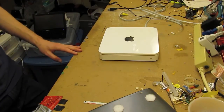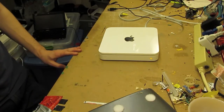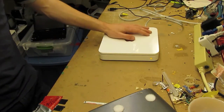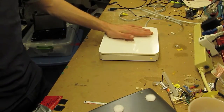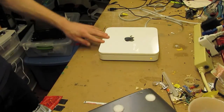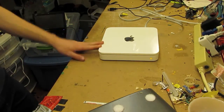The caps in this one are probably dodgy and failing, but not already failed all the way, since it does manage to power up and does seem to be stable when it's just sitting here. So I think the next step is to take off the case and have a look inside.